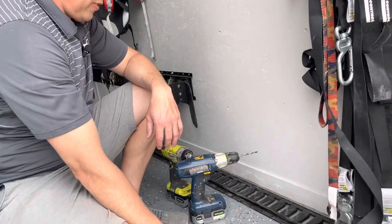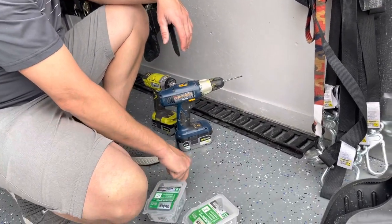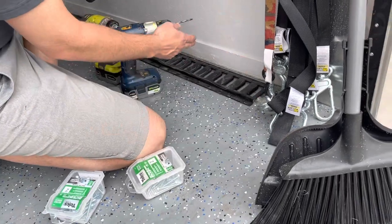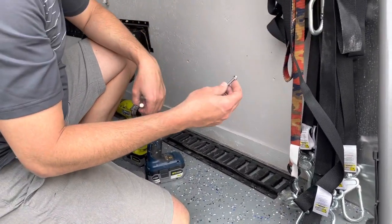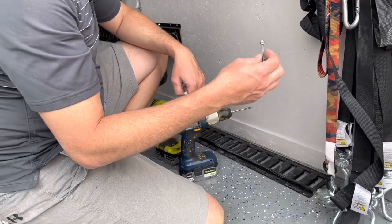What we're doing here is finding out where your stud spacing is. On this particular trailer it's every 24 inches. I've got a metal cross member — that's where I'm going to screw. I'm going to use these metal two-inch self-tapping metal-to-metal screws.